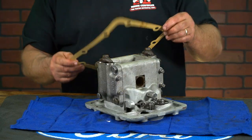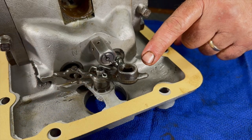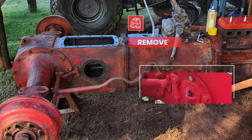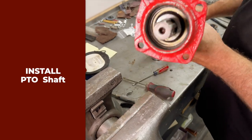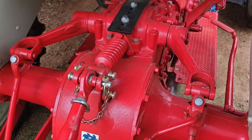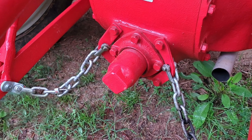All that is left is to set our new gasket into place on the pump, making sure the hand lever assembly engages the hole on the rocker as you raise it up. This can be done by removing the inspection cover on the right side of the tractor. Now you can reinstall the PTO shaft on the tractor. Refill with clean fluid and check for proper operation. As long as your top cover is in good condition and adjusted correctly, your hydraulic system should be working like new again.